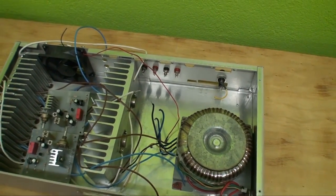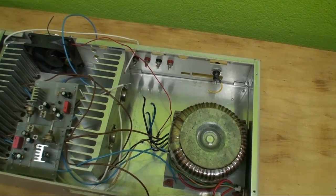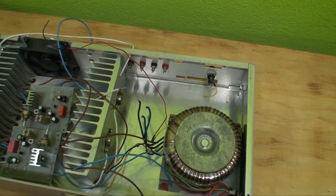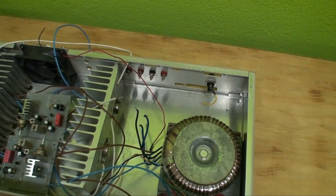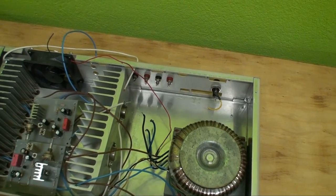That's going to be another board that I'll have to build — a little relay control and a little speaker protection circuit, along with a 12-volt stabilized power supply for that. I'm then going to add a little voltage divider to get my 6 volts out of it for the fan.